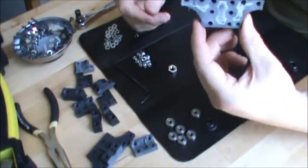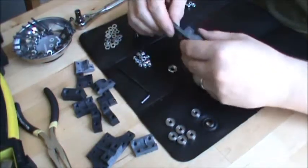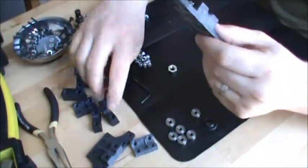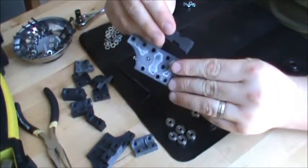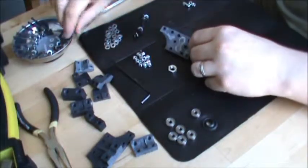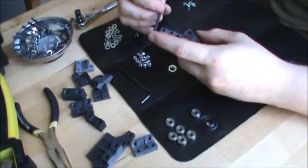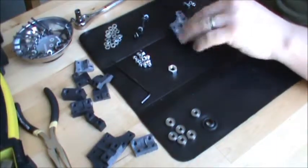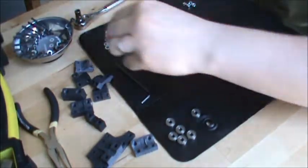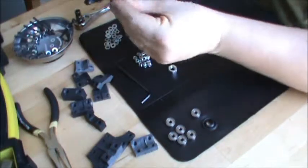What you basically need is this piece to start with and I'm going to build it from one side to the other, trying to build it up piece by piece. So what you need is this — it's a bar clamp. The bar clamp mounts right there. Grab yourself an M4 45 millimeter with washer. Slide that through. Slide it on. One more, and you're in.